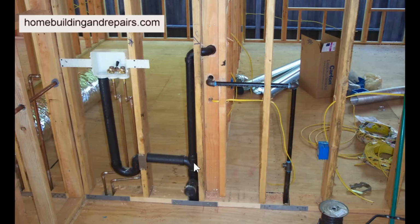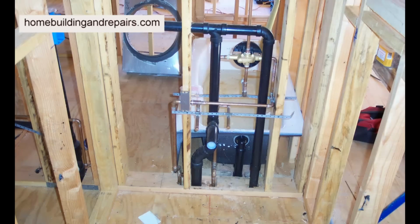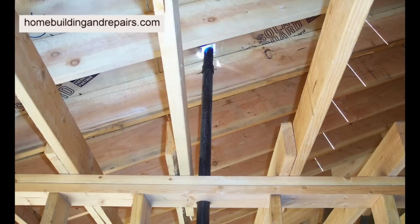Another situation here where the drain goes in through a wall. So this one right here, you might think, hey, wait a minute, the drain goes up and it's close enough to this because it's only off a little bit, and you're thinking, I'll be able to run it down through here. And that's fine as long as the clog is not in here. Another situation again, if this is the drain you're looking for, the snake is going to take the easiest route and go down this way.